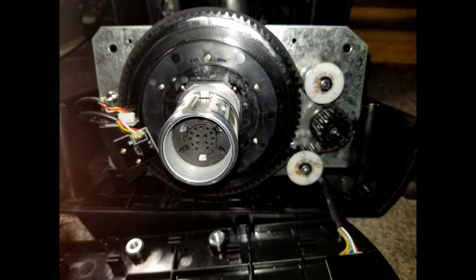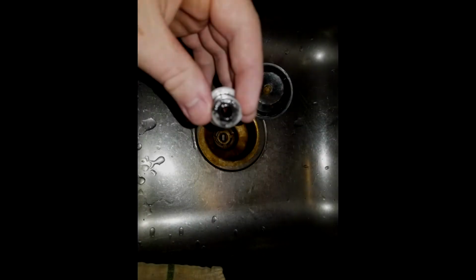And the two pulleys were what was squeaking for me. So I took them off. The factory grease had just gone. They were really gunky on the inside. I just take the C-clips off the end of the pin, and the pulleys come right off. I washed them with good old soap and water and got all the gunk out. They were pretty nasty, to be honest. After 1,000+ hours, I'm not sure if it was belt particles or what it was that was dirty.